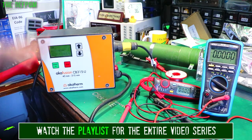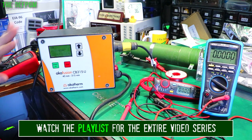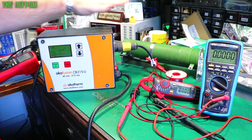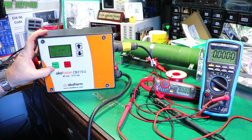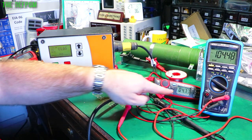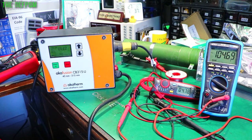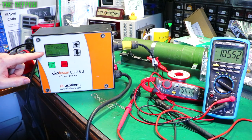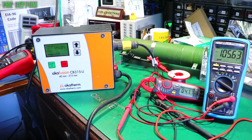Excellent - I've put this back together again, sealed it all up, put my seals on it. So if it's going to fail, this will be it. Now it's all back together. Let's give it a go - this has cooled down, it's still fairly warm, probably about 40 degrees. Does it work still? There we go - 4.8 amps still again. Voltage still good. I'll do a full weld on this again, and if this works fine then I'm happy - I can give it back. Temperature readings looking pretty good, it's only 26 degrees. My meter over here is 27. There's a bit of accuracy on thermocouples, plus or minus 1 degree. Now it says 27 as well - so there you go, it agrees.